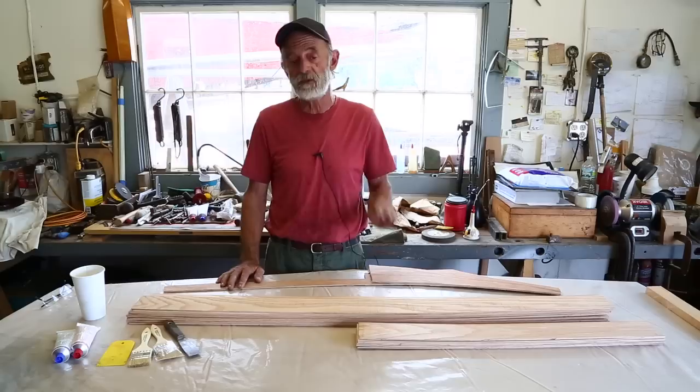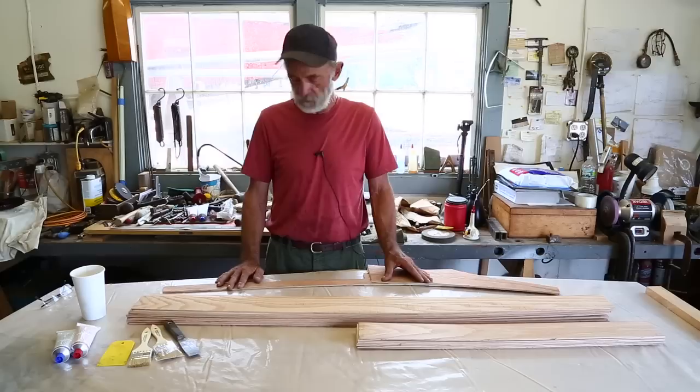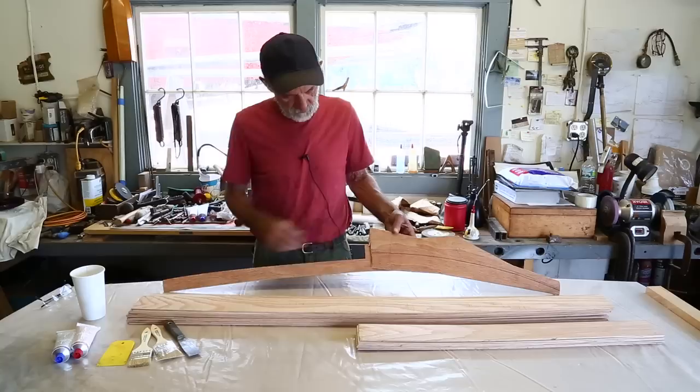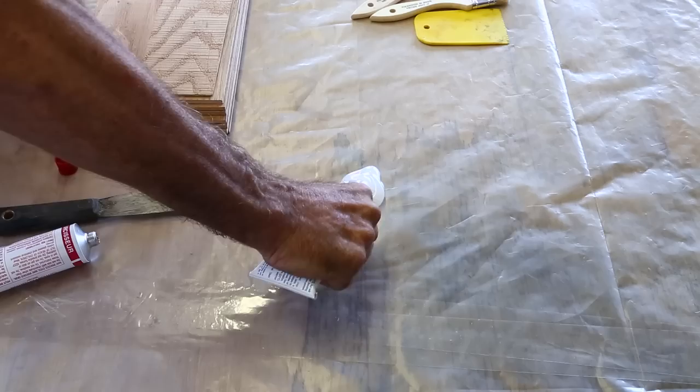After having reviewed that effort, we decided to change gears and laminate the forefoot out of some nice thin laminates of oak. We've prepared the laminates and we're just about to glue them up. The reason I've got two different length laminates is because of the way the pattern works out — some carry all the way down to the floor timber just ahead of the mast step, and some stack up deeper to make it down into the cutwater area.